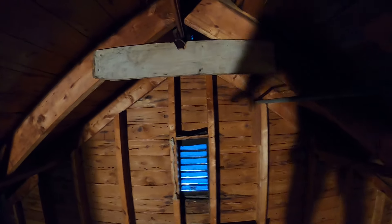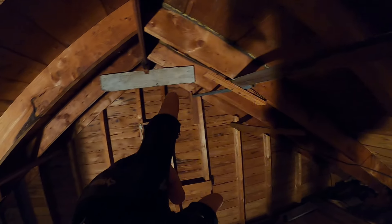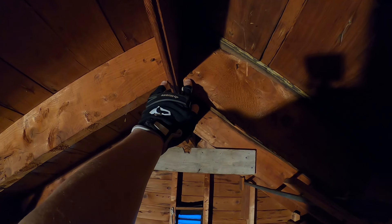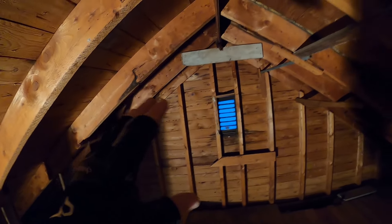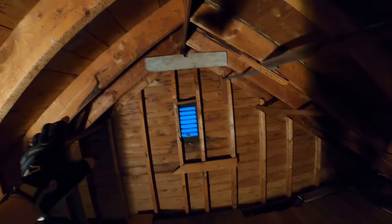This single piece right here is a good representation of a collar tie, or where it should be — although it should be lower and it should be bigger. Typically they're installed in the top third of the roof rafters. What they do is they prevent the roof rafters from separating at the ridge due to wind uplift or uneven loads such as snow loads. It's my belief that this also helps the roof rafters from not spreading, and if there's an uneven load, it will help to balance that load between the roof rafters it's attached to, making the overall structure stronger.